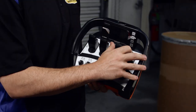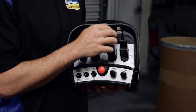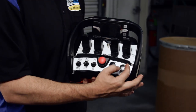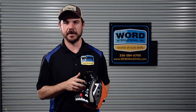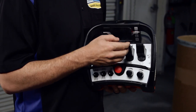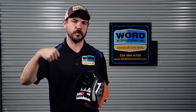Now that you know how to start it and pair it to your machine, I'll give you a brief rundown of all of the knobs, all the buttons, all the functions. What we have here is your rotation control, which controls the rotation of your drilling motor — which direction you want your bit and the RPMs of your bit. You can also control the pressure of your bit, thus controlling the torque of the machine. Beside that, we have the feed of the drilling motor itself as it moves into the ground, so you control going down and going up on the machine. This also controls the pressure of how much downforce you put onto the ground.